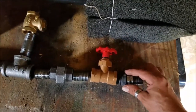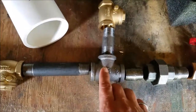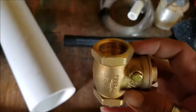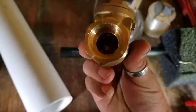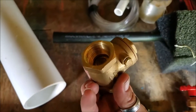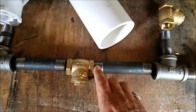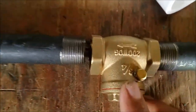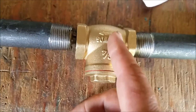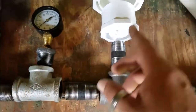Your poly pipe hooks up via a three-quarter coupler into a shutoff valve with a nipple, then to a three-quarter union, a nipple, and a T. From that T you come up with a nipple to your swing check valve — notice the arrow points down. Inside there's a plate bar; as water comes in it pushes up, seals it, then pushes down to release the air, and it self-primes and fills the line. A second swing check valve is oriented so the flap stops backflow, which forces pressure to build in the rest of the line.